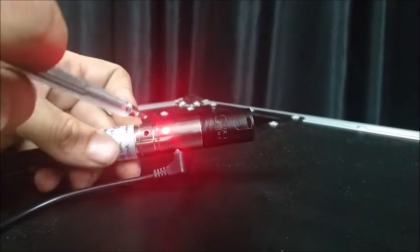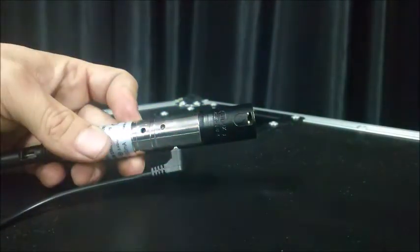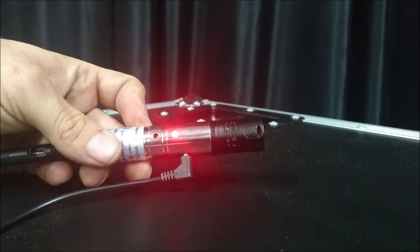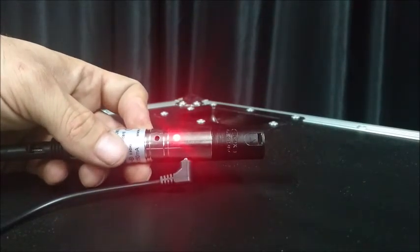Once you have done that and selected your protocol, you can press and hold the button until it goes white again, and now it's set up as a transmitter. You only need to do this once, as the unit will remember what setting it's in upon power up.